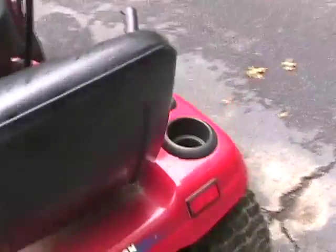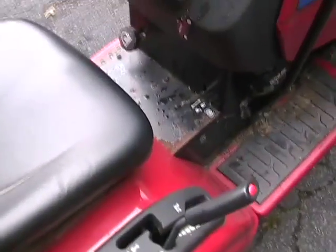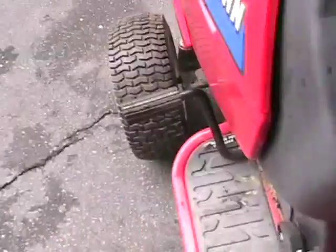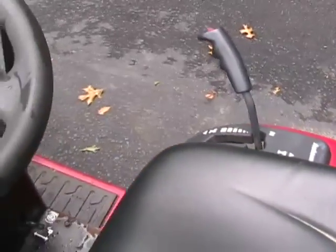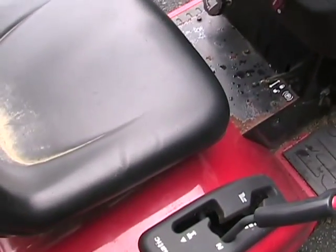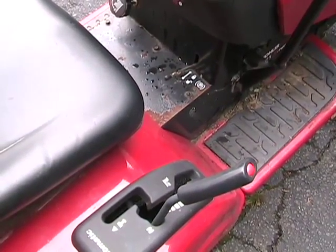This tractor kind of has something that's very annoying, which I guess more and more newer tractors have. The Scotts has this, and I hate it because of it. When you have the tractor in a gear, on the hydros, and you press the brake pedal, it slams that into neutral. And in reverse does the same thing. So every time you try to use the brake pedal to stop, when you need the brake, it goes into neutral, and then you have to move it back with your hand, which is a real pain in the ass when you're not used to it. Ha ha ha.